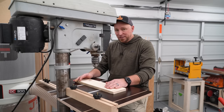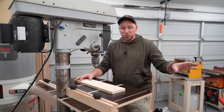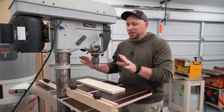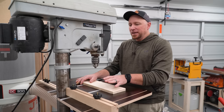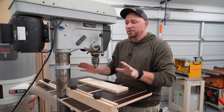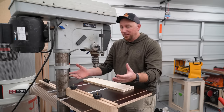It's not very often that I need full capacity, but it's nice to have. With a normal single fence system, you can take the fence off and set it aside, but I don't want to do that. I want everything to stay here. One problem with having the router table built into the table saw is that if I need the full capacity of the saw, I have to take the router table fence off. I didn't want to do that with this — I want everything to live right here. With a split fence, you have full capacity and still have the fence available, or it tucks out of the way if you have an oddball piece to put on the press.